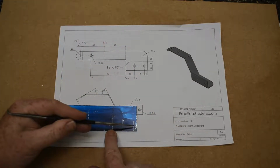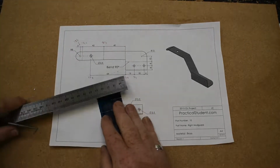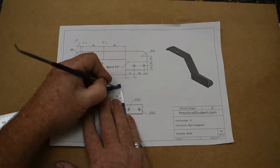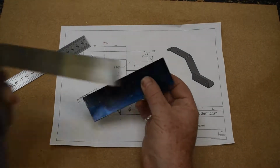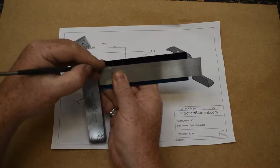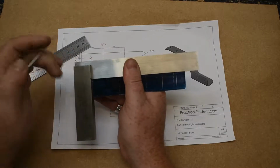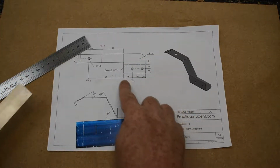So look at the holes here, they're up 8 and then another 8 to the bend line here. Again, from this bottom left corner, I'm going to measure up 8 plus 8 is 16. T-square those across. And we only need to T-square the 8 on the second line, and the 16 then we can T-square up to the third line. So we have that bottom section done here.